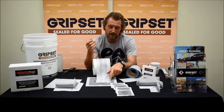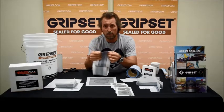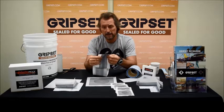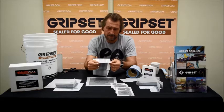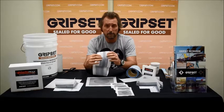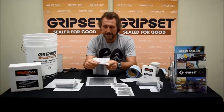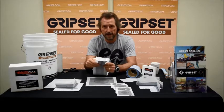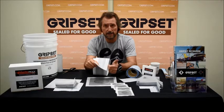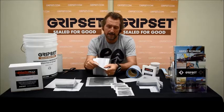You need both high strength and elastomeric properties at those jump joints and junctions. So the Elastoproof range is a rupture-resistant bond breaker, but it's more than just a bond breaker — it's actually a waterproof joint band. The way we make it, there's rubber inside with a reinforcing fabric that is welded or vulcanized into the rubber during the production process. That free zone gets wet into our liquid membrane, creating the bond breaker and taking care of the most critical joint in a wet area or waterproofing application.